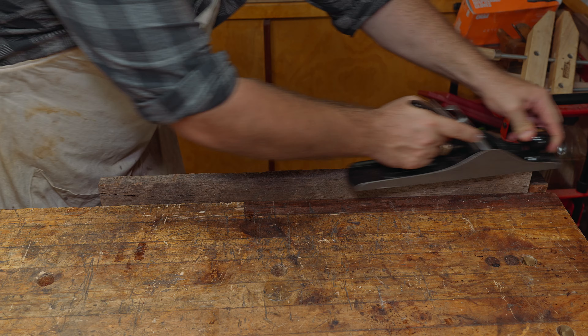There are two different ways to square the edge depending on whether you use a camber or not. Let me tackle using it without the camber first, and then I'll talk about how you do it with a camber. The process is fairly similar — it's just a different spot where you hold the hand plane. When we're looking at edge jointing correctly we first need to look at how the blade is sharpened. I don't use cambers, so I'm going to show you my way first, which is rolling the edge of the blade.